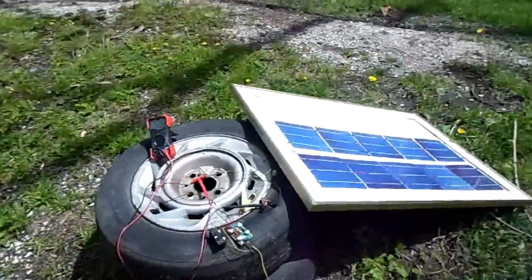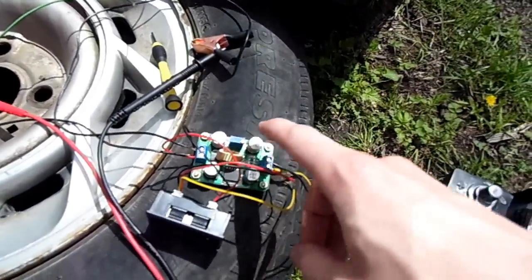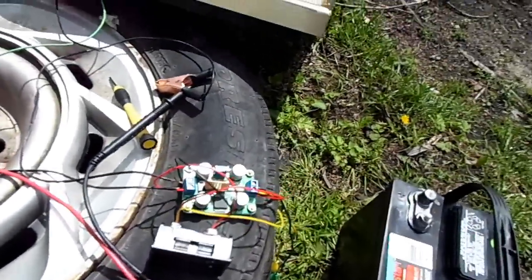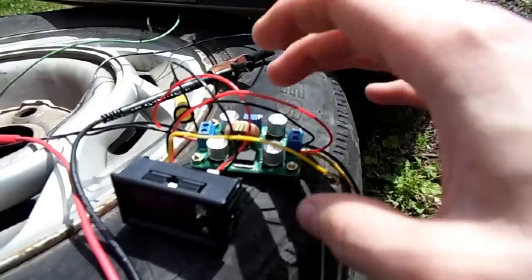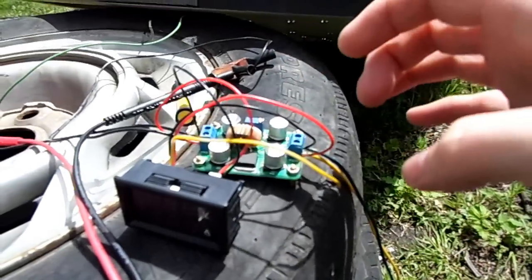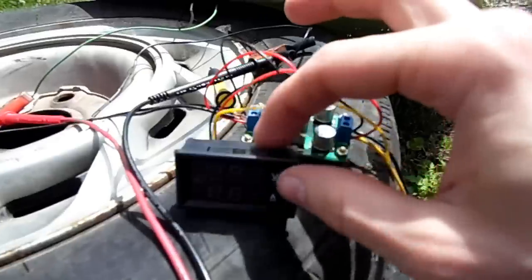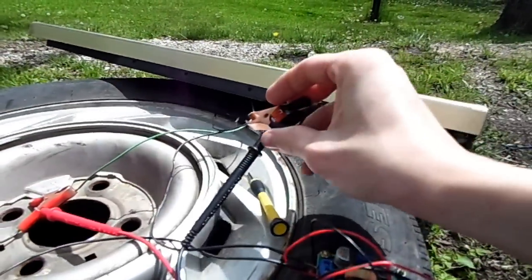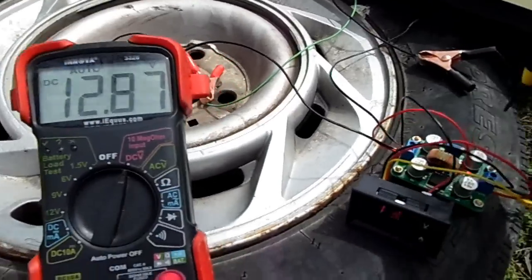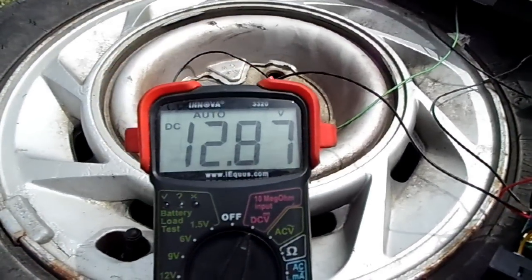Here it's facing the sun and I have this little 3.5-volt to 30-volt step-up transformer. It'll take in anything from 3.5 volts to 29 volts and put out anywhere from 5 volts to 30 volts. I'm connecting it up here to step up the voltage — I have it turned off, and now let's slowly bring up the voltage to see how high it goes.